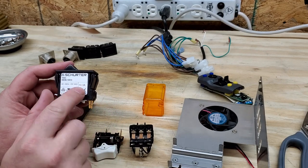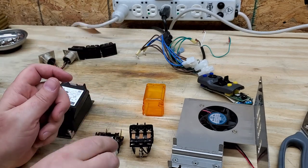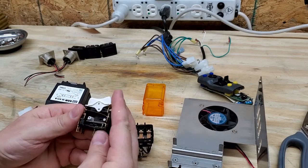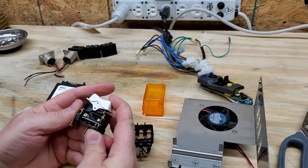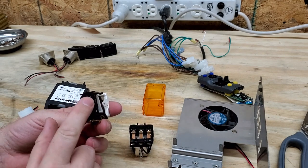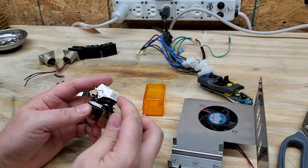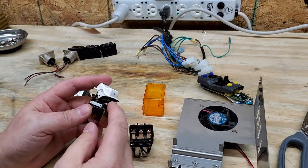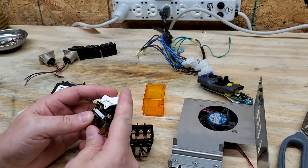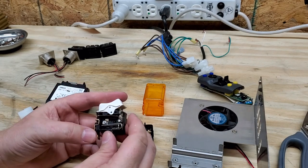So when it reaches a certain current it triggers, and I'll show you how that works. This is one of those exact same types of power switches right here. You can see it — this is a dual pole or two-pole, single throw because it only clicks one way. So you can see it's normally open, then you hit it and they go closed. But there's a cool trick that this guy does, and you can see it's identical on each side.